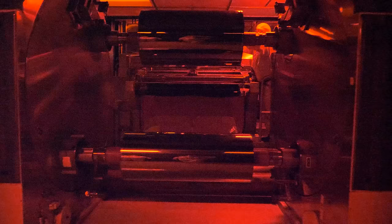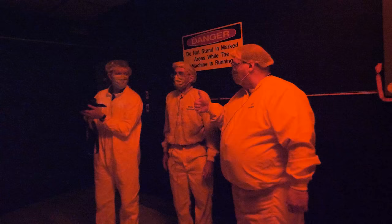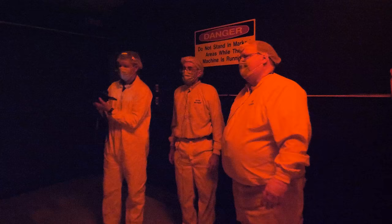So: the coating process happens, the splice occurs, and I've got this roll feeding in through the machine — accumulating there. He's getting another roll ready to be spliced. That first spool is now at the unwinder. Samples will be taken and sent to the testing group. The people in Jeff's group in the other building are looking at it in about 45 to 50 minutes and they're going to determine whether it's good enough to sell. They'll look for defects and also check the proper exposure levels — the sensitometry — that it covers the right exposure levels for the product. If it's off, they'll make corrections to chemical flows.